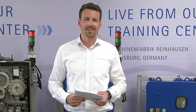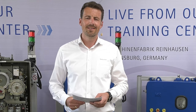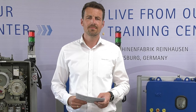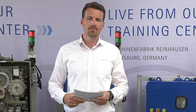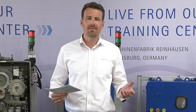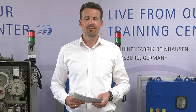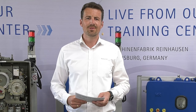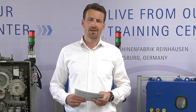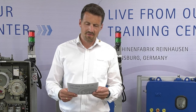What is the motivation behind doing a motor drive retrofit from an end user perspective? This is the question you may ask. As you probably know, nowadays the lifetime of a power transformer is increasing. 40 to 60 years is quite normal. Well, you do not need to be an expert to see that 60 years is a bit difficult for an electrical drive mechanism, which is equipped with contactors, electrical parts, terminals, wirings, and so on. Additionally, technology changes or digitalization requirements are also aspects which influence the decision to replace a motor drive unit earlier or later.